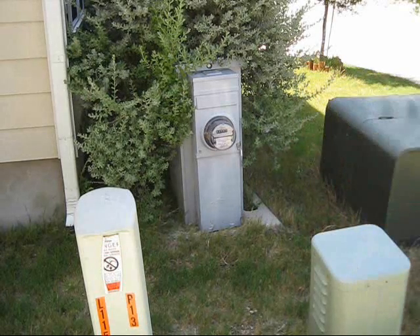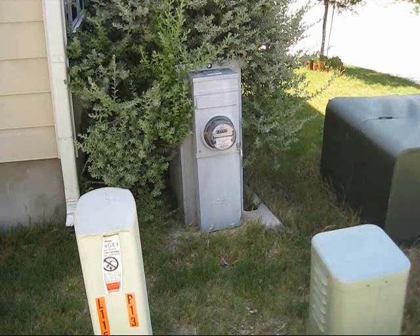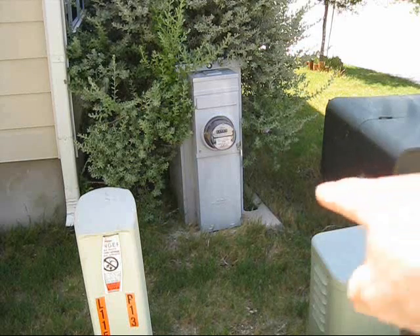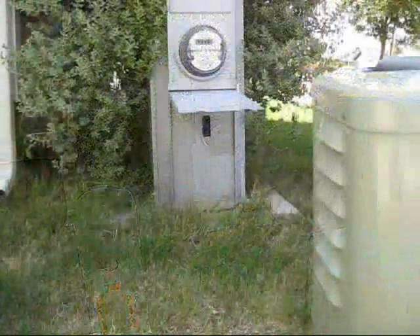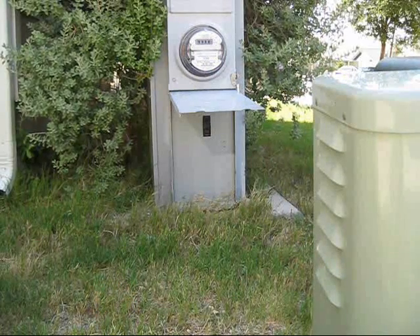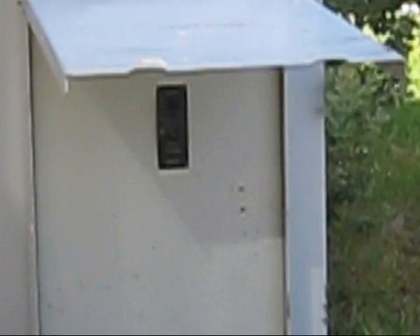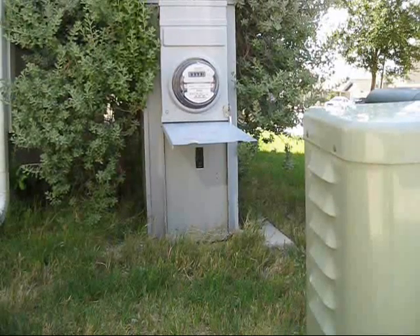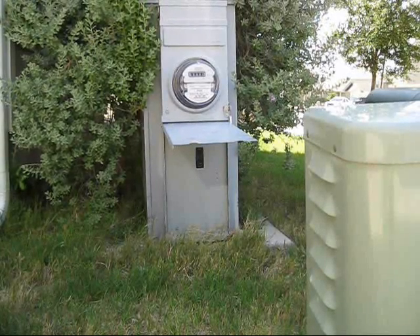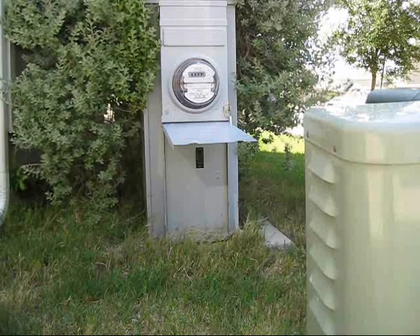In my case it's easier to just go ahead and shut this off. You probably have something like this little meter panel. I'm going to open up this little panel at the bottom — when I open that up you're gonna see one switch in there that shuts off power to the entire house. You just want to flip that switch, and once you flip it, power will be off to your house, located right underneath the meter.